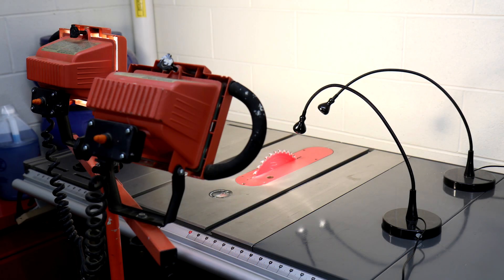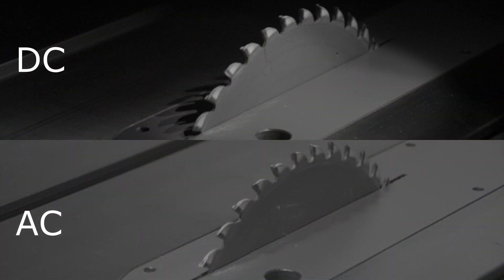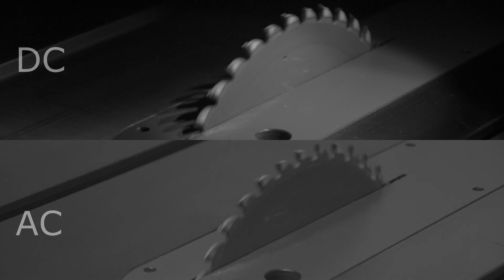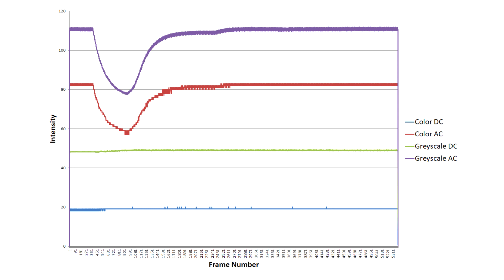The best DC lamps I have are a couple of IKEA LED desk lamps that I use for a microscope. The IKEA lights are dimmer, consuming 1–2 hundredths of the power of the 1000W halogen, but the light is more directed. For testing light stability they'll work fine. The previous dip in light intensity is gone because the LED lights are consuming so little power that they're not competing with other loads. YouTube's video compression helps emphasize the difference between AC and DC lamps — it converts smooth gradients into uniform regions of gray. The bands show the boundaries between those regions. The bands in the AC video are pulsating because intensity is constantly changing, while the bands in the DC video are stationary because the light is constant.